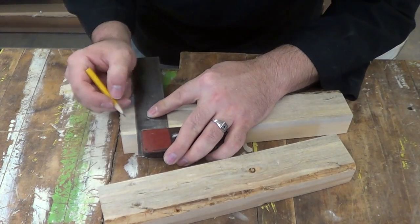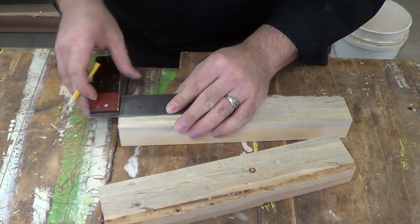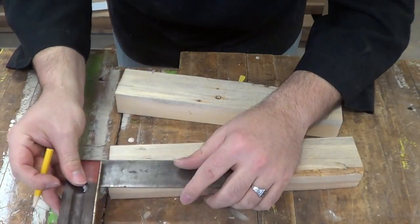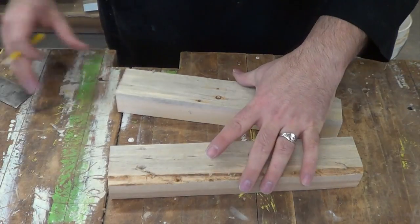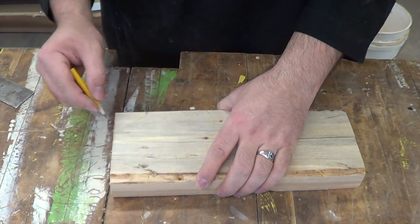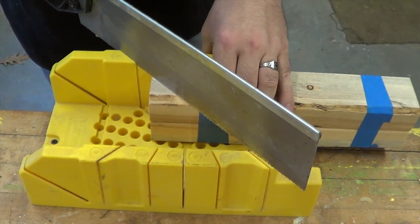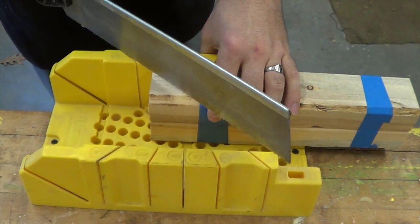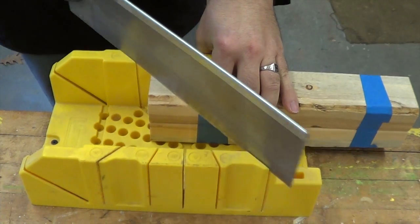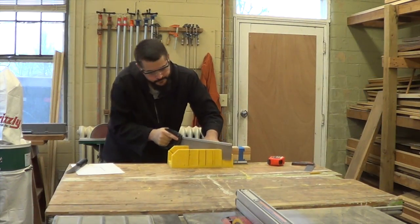I'm placing a mark three quarters of an inch from the bottom of the jaw — that's going to be where the 45-degree angle begins — and I want to do that on both pieces. I'm also roughly marking out the direction that the cutting is going to go so I can keep everything properly oriented. I went ahead and wrapped the jaws together with some painter's tape so that both the length and the angles are the same on both pieces, and then I'm lining it up in the miter box at the 45-degree setting, lined up with that three-quarter inch tick mark.